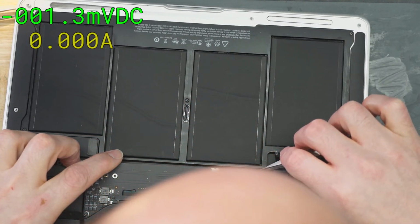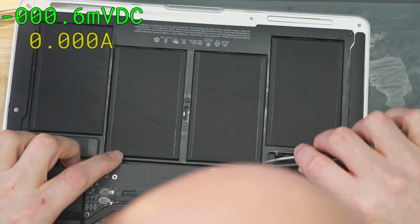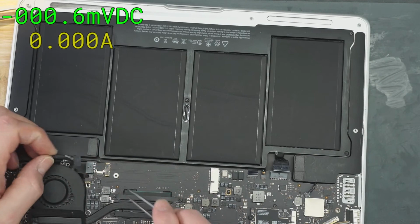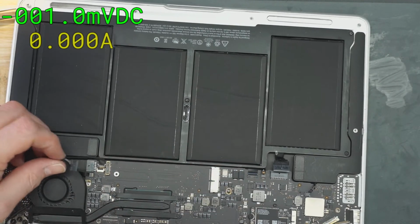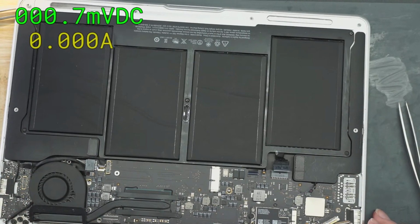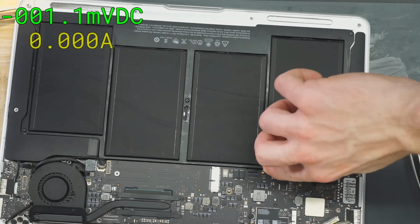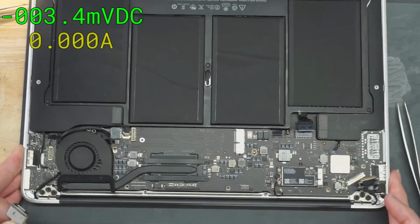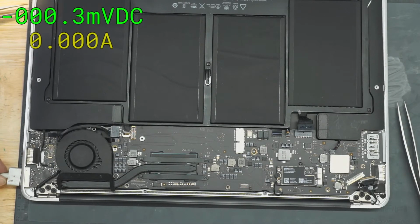500 milliamps? Let's find out. Oh, you connected. No, I just don't want them underneath the board. Could the backlight cable potentially short out a tiny cap? The keyboard backlight could potentially short out a cap because it's exposed. I would think so. I've never had it happen, but some do. I've seen the antenna wires, the antenna connectors short something out before. Okay. That's happened.